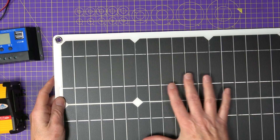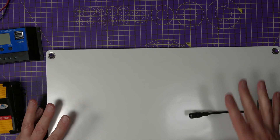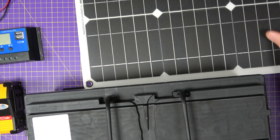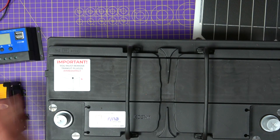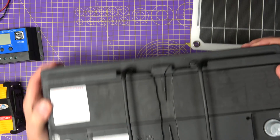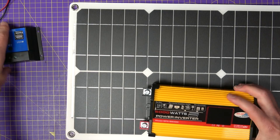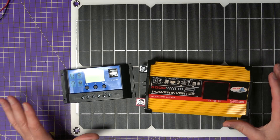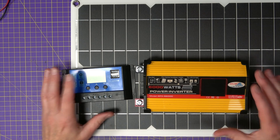The solar panel is quite small, not too big, and this is a monocrystalline silicon type. It's 18V output, 18W of power, and the spec says it's around 20% efficient. And I've got this monster 12V 100Ah gel lead-acid solar battery left over from another project. It's a bit over the top for this, but I had it anyway — why are these things so heavy? Now, all this is built to a price, but I knew that when I ordered it. I'm going to get these wired up and checked on the bench, just to make sure everything's working, and then figure out how to get it installed in the shed.